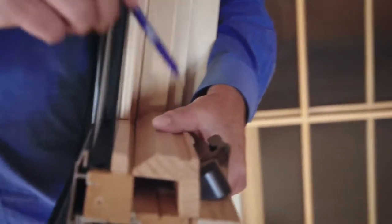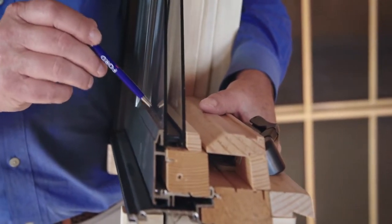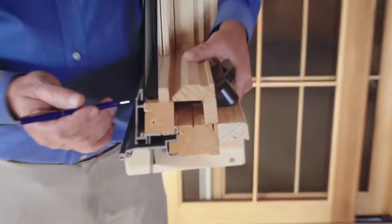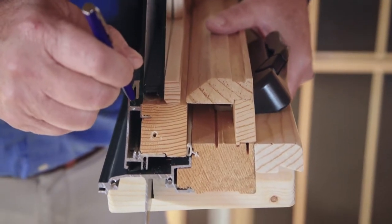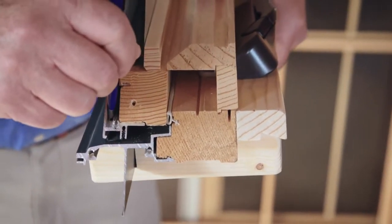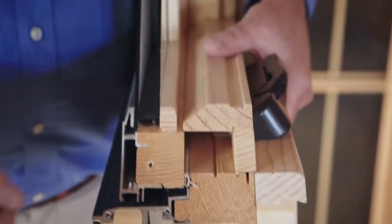Here I have a cutaway of our aluminum clad wood window system — this is the exterior, this is the interior. It's not a matter of if but a matter of when water is eventually going to penetrate where the glass and the aluminum meet on the exterior. We use 100% neutral cure silicone to try to prevent water from entering this area, but because of expansion, contraction, and temperature variances between glass, aluminum, and wood, water will eventually find its way in. Once it does, our proprietary water management system channels any water that drips between the glass and aluminum into a trough with a weeping system where the water falls into the path and weeps to the outside. You also have a secondary and primary weather strip — it's like a water ventilation system outside of the weather stripping to make sure your wood is preserved and protected for a very long time.